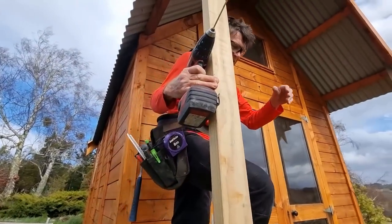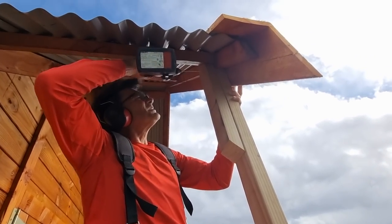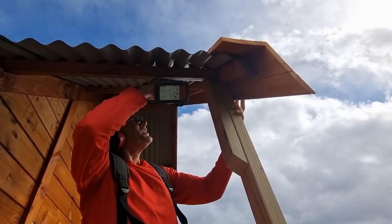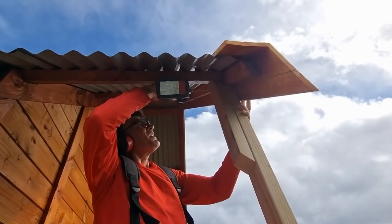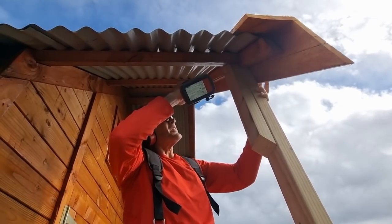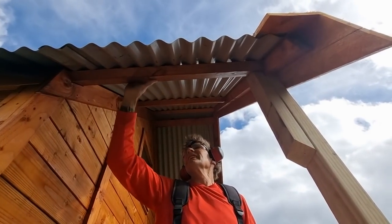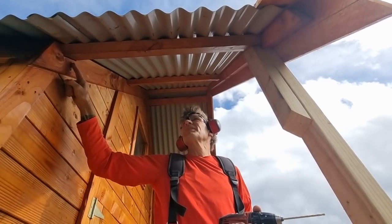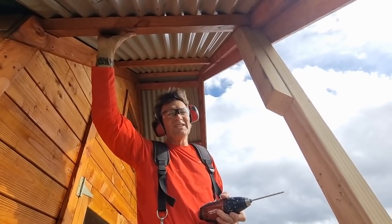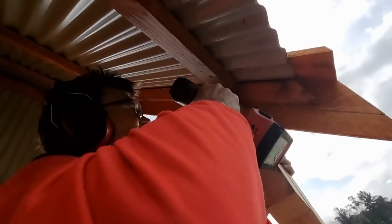Gee, she's windy, bro. It is windy. This is a big overhang, considering. It was flapping loose. It was flapping, yeah. Do you think that they should be always secured, or just because we're in a high wind area? Well, look, if you were to go for this kind of overhang, these bits of timber would be on their edge, at least, or they would have an outrigger going back. Right. To strengthen it, but really, for a high wind area, this is too big an overhang, 900 unsupported. Right. We're in a very high wind area here. Yeah. So it just flaps, you know.